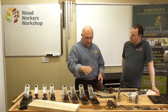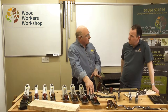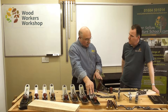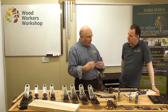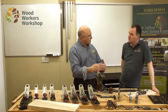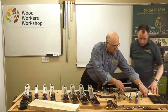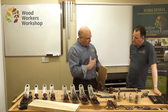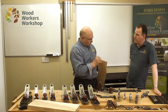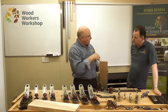You can actually get a really good finish on most timbers with a cabinet maker's bench plane, utilising the adjustment of the frog to give you the aperture required for that type of timber. If you're working on end grain, for instance, taking a shaving across that end grain, you would have the mouth set extremely tightly so that we don't get any breakout from the edge, and it's also supporting the fibres in front of the blade.